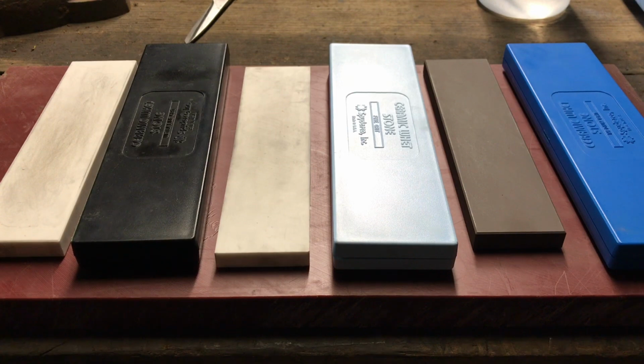So what I use is just regular. Basically all the knives I use and have used on this sharpening system are around 60 Rockwell hardness. If you have the same thing, like CPM 3V, Vanax, LC200N, S35VN, O1, all that stuff, if you have those steels in general in that area, then I think these are perfect. These would work great.